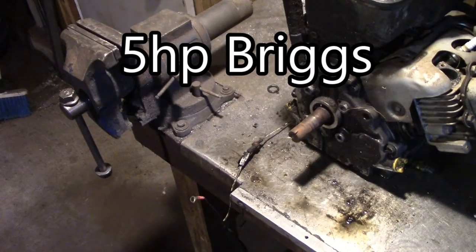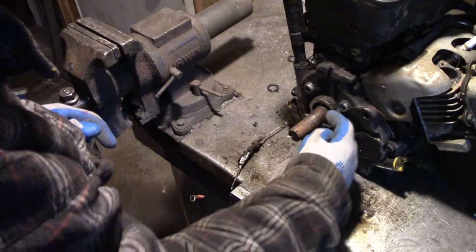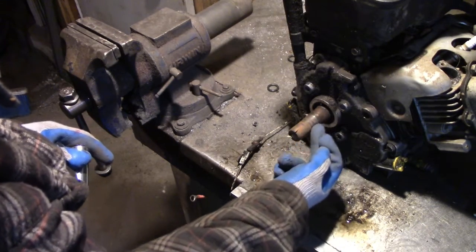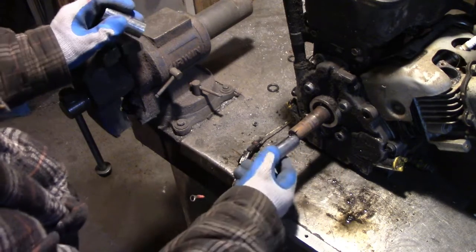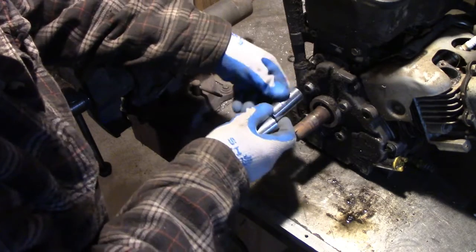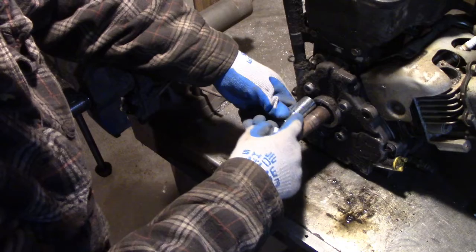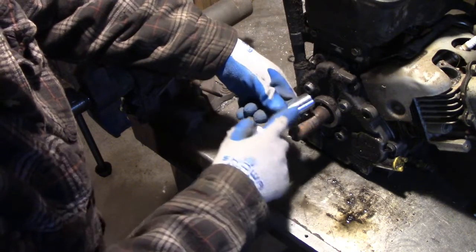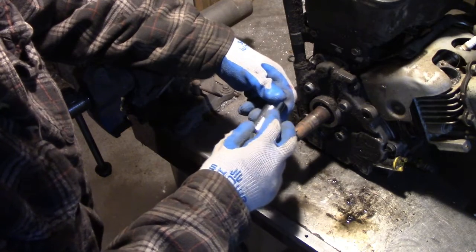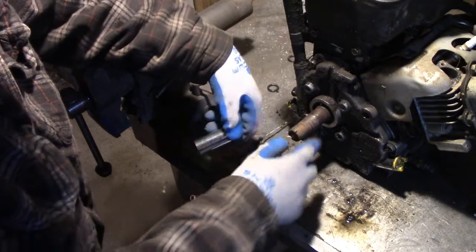Let me go over and show you. I want to get as close as possible to this. So this is the 1-inch deal under here — a little over an inch that it comes out, then it tapers down to the 7/8ths steel here. So I just marked it right here. I'll cut it here and then try to taper it like they have theirs. I'm not sure how I'm gonna do that yet — I have a flap wheel, but that's gonna be hard to do evenly like this.